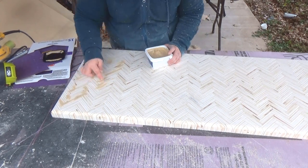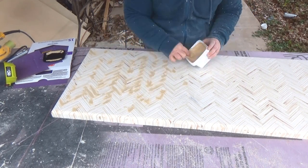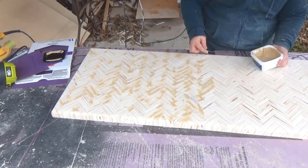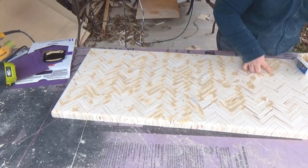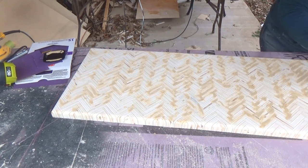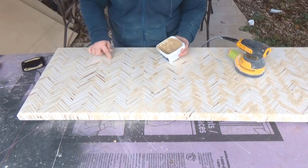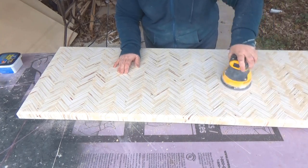After a little more sanding, I pulled out wood filler to fill in all the little voids and cracks in the tabletop. It took me only about two minutes to realize the better approach would be full trowel wood filler — the kind used on hardwood floors — where you just trowel it over the entire top, let it dry, and sand it. Unfortunately this was all I had on hand, so I went with it, but the full trowel method would definitely be the way to go.